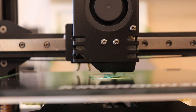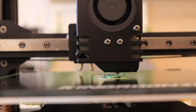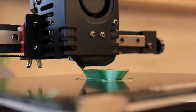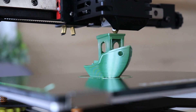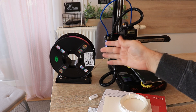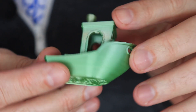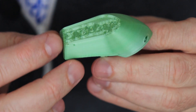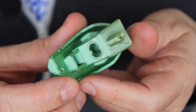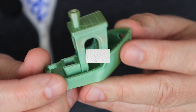The first layer is down and it doesn't look perfect, but it's finished. That's what I don't like about this glass — you must have a perfect distance between the nozzle and the top surface. That's why I prefer the PEI sheet, and I highly recommend you buy that version because it is less sensitive to human errors. The printing is at 20% and progress is good. Printing is finished — it's good. The Benchy is completely green so there's not much use of the rainbow filament if you don't print a really big object. The Benchy looks good with no problems on the side surfaces. Seam lines are quite hidden. The back text is not readable, and there's an interesting surface artifact on the edge of the door that I've never seen before. But otherwise quite good from this printer.